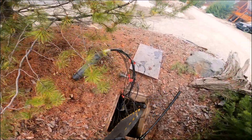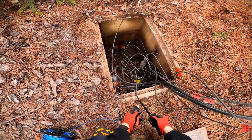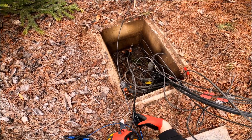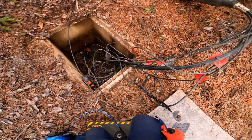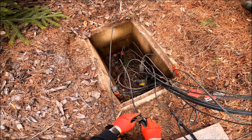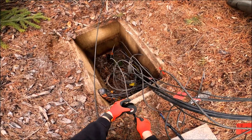Coming over to the tub — here is the copper line I'm using. I don't want to pull too much because I don't have much slack at the other end. This was taped on for my first attempt, but then I found the copper drop was stuck, and then I had the hydrovac come out. If you're dealing with a small conduit — maybe a one-and-a-quarter or one-inch — you'd want to tie string to this and then tie the string to this so it's flat and not doubled up. But for our purpose this will work.